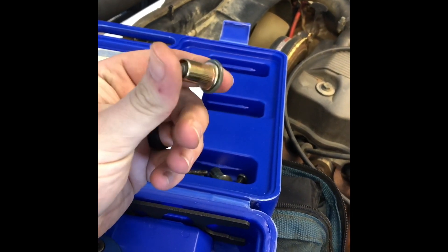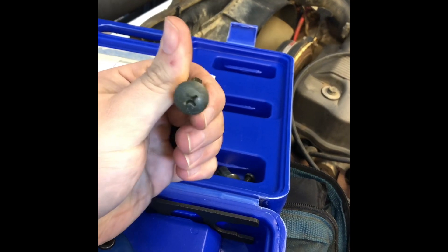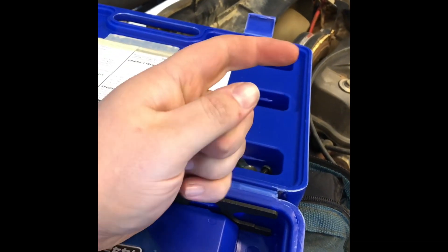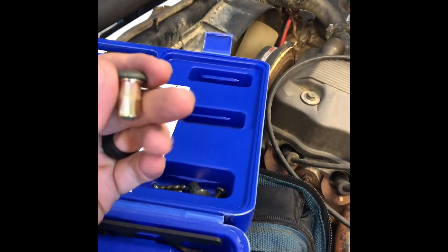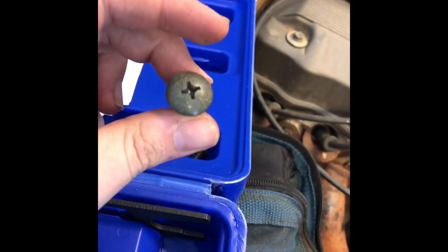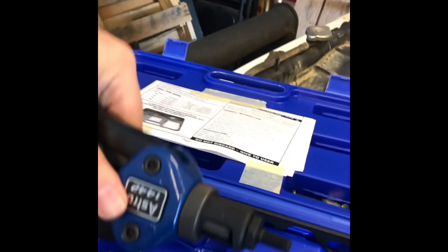So I was trying to figure out what to use to screw this in there. I went through my bucket of bolts and found some old screws that I think actually came out of this Samurai. I found out they are M8 thread, and I happen to have a nutsert tool that has M8 inserts, so I went ahead and put it in there. Here's the tool — if anybody's interested in buying one, they're not very expensive.